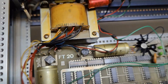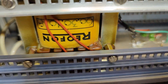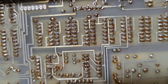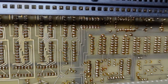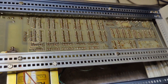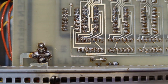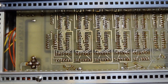The red wires come from that filter here on the bottom, and the red wires go to the switch. It's a two-layer circuit board — a very beautiful layout, all the tracks are nicely laid out. I'm quite impressed for a 1970 design. This was made on transparent film and little tape reels, so you can see some of the tracks a little bit out of alignment, but they're pretty good for the way it was made.